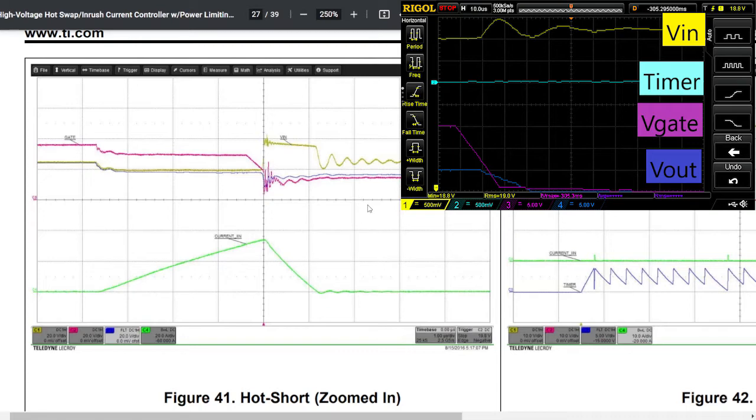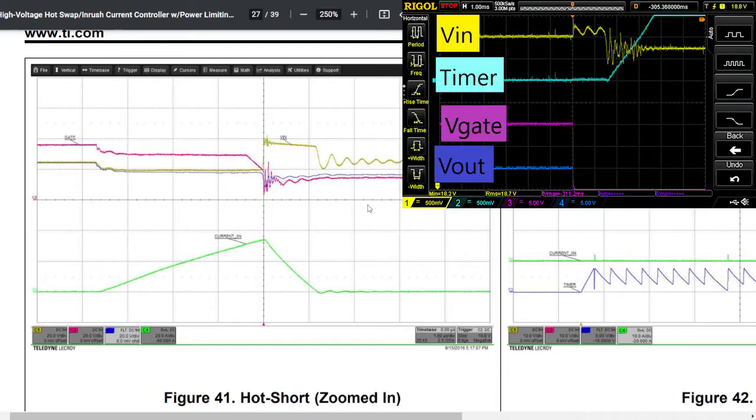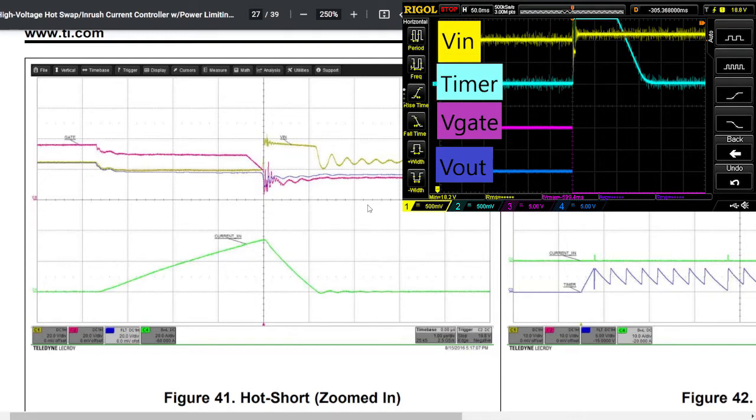Since the power to the gate is cut off, the output of the MOSFET is cut off, the light is off, and otherwise no problems. I know that there is no excessive current consumption, because I monitor it through other means. So the reason that the light eventually shuts off and never restarts is because the timer times out while the output voltage is low because the MOSFET's never conducting.